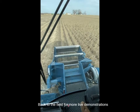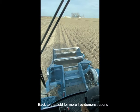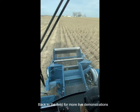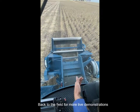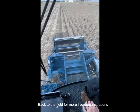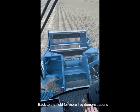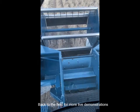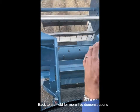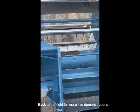You can see the reel flaps on the reel — it's a nice sweeping motion that cleans the front sickle and the front floating pan. With the auger itself, it brings out all that material. When the header is raised, you can see how it sweeps the header clean. The conveyor belt and beater bar bring all that material together, making a mat to feed into the rotor itself.